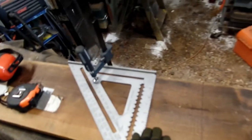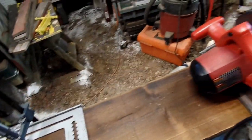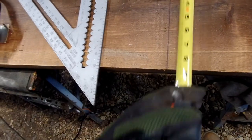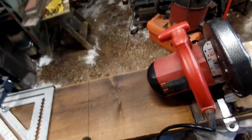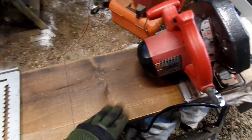I've got my square and a line right there. If you put a square up against it and use a good clamp, you can butt this guard against it — it's exactly five inches to where the cut is supposed to be. I've got my ear protection set up and I've got this set up to barely cut through that — it's about 9/16 inch thick. This is off an old waterbed, so I'm reclaiming the wood. That's what's saving me money on building this. I'm going to cut two of these and I was showing you guys how to make a proper straight cut because it's tough to really make a good straight cut.